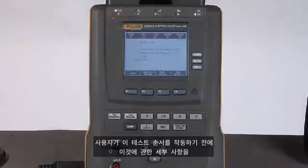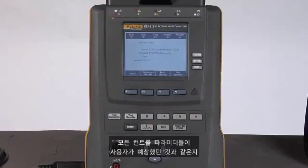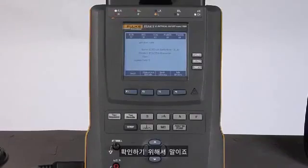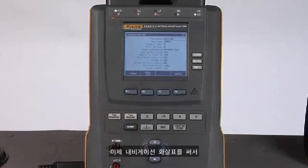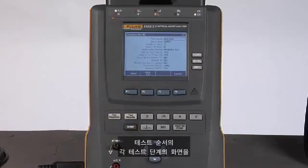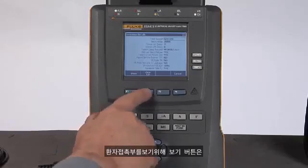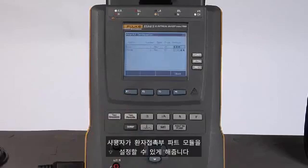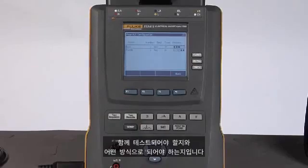If I want to see the details about this test sequence before I run it — just to be sure that all of the control parameters are as I expect them to be — I will press the F2 button and use the navigation arrows to scroll down through each of the test steps. The view applied part button allows me to set up my applied part modules, that is which groups of patient applied connections should be tested together and in what particular way.